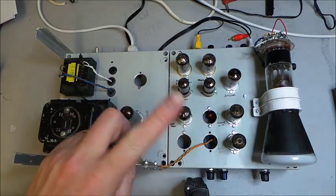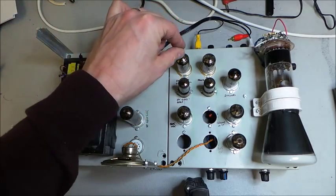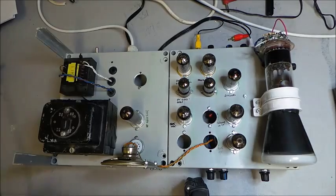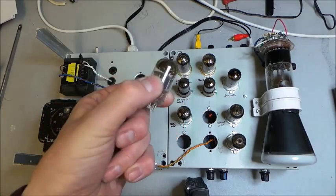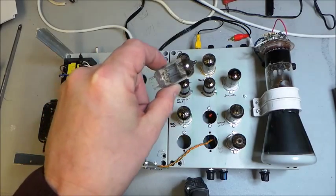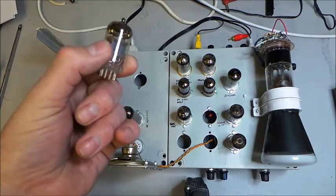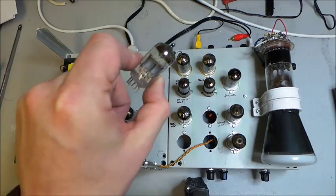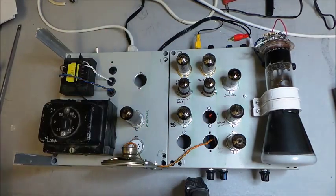Right, we need to deflect the tube as well. Oh yes. Right, so also from the first video amplifier, it feeds this double triode in here. It is a 6N6P. There they are. Got hundreds of them. Big batch of them out of Russia. It's sort of an ECC88 come 6DJ8 if you're that side of the pond. But it uses a lot more heater current, actually. But super little tube. Sorry, this is 6N1. What am I talking about? 6N1. But that's the sort of equivalency. There it is. Very good. Got a box from Russia, super little tube.